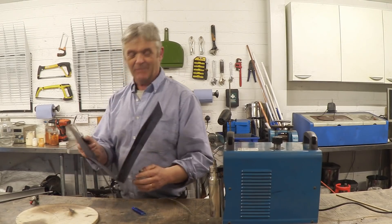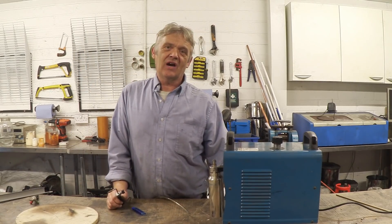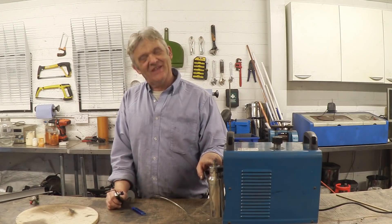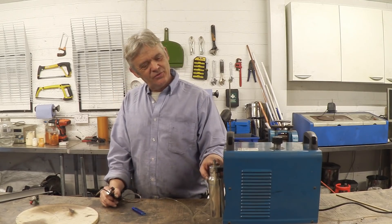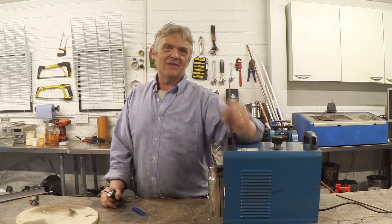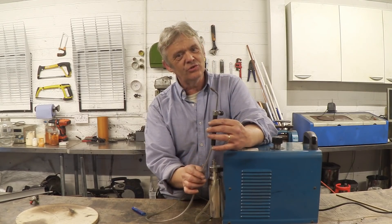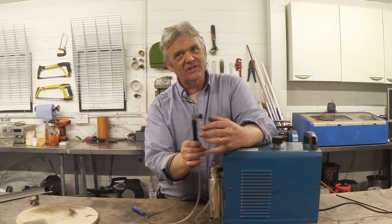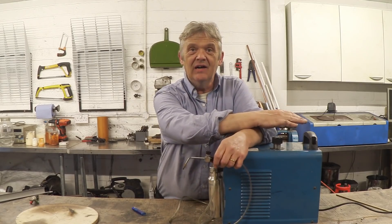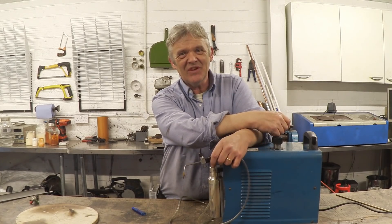That's all I've managed to do so far — put a couple of bends in some polyethylene. I'm probably being unfair. I did watch a guy who changed the mix from water to a water–alcohol mix, but that bubbler is the actual flame arrester, so I'm a bit hesitant to do that. He gave good reports on it though. I'll play around with it a bit more to see if it's actually something more than a toy — it's meant for jewelers I think. It won't do any serious work at the moment, but I'm really pleased to know what's in there and that it works. I thought I'd share that with you — I hope it was of interest, and thank you for watching.